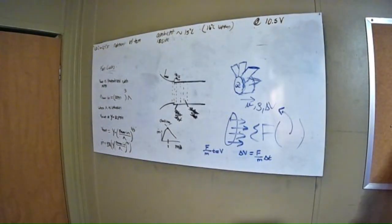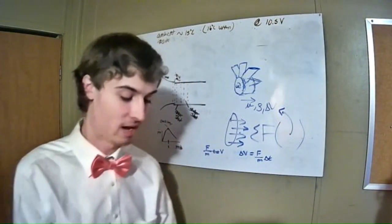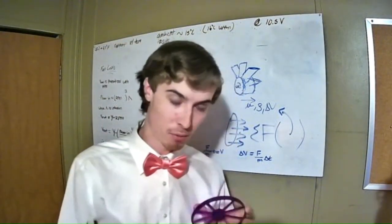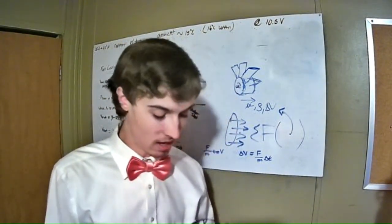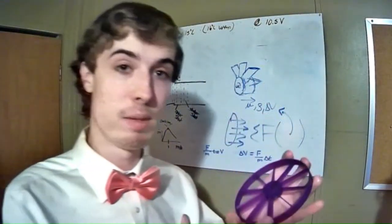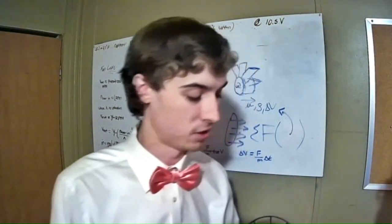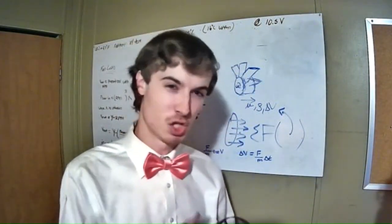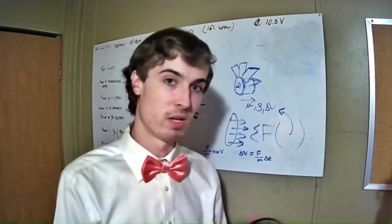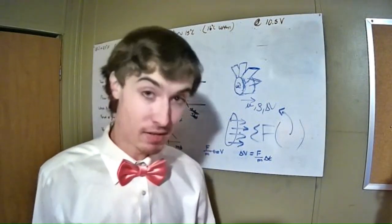Essentially, it'll burn out and you can put liquid metal in it and have a perfect cast. So they say. The reviews are good, so I wanted to try it out. So I printed these rotors. This is a 115% scale of the ones that actually go in this tester, but that's just so I can get the wall thicknesses of the rotor thicker to make sure it prints right. And so yeah, that's another project.